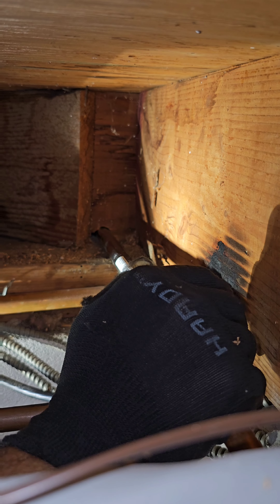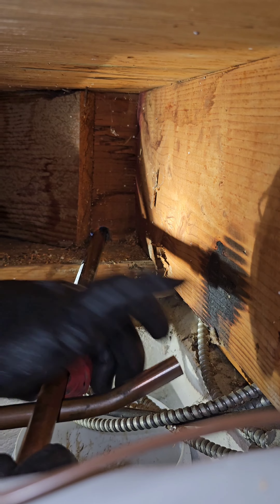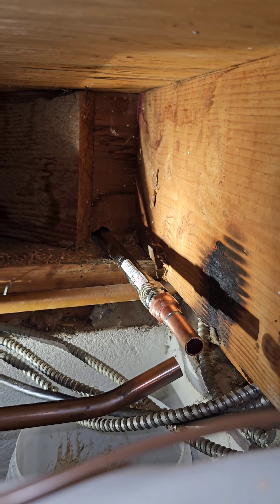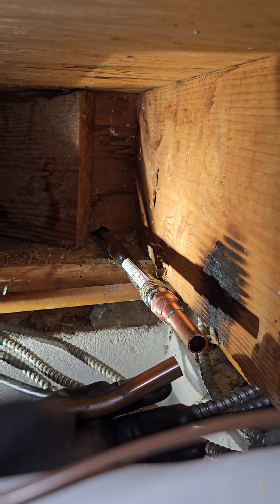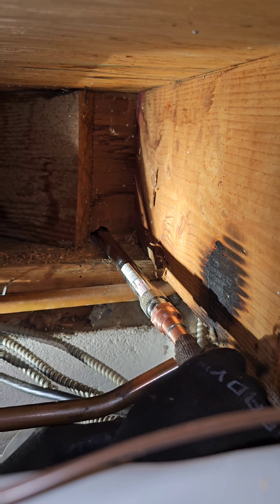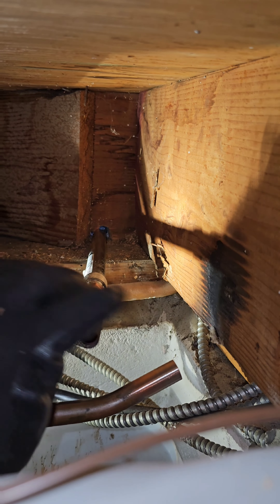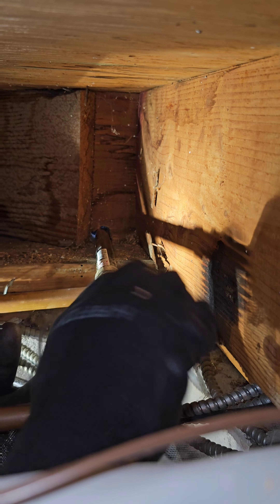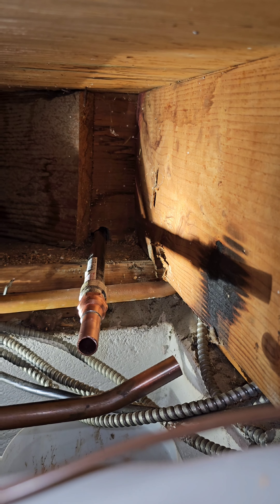Once he pushes it through, I'm inside and I mark it out exactly where it needs to be cut. I pull out the Milwaukee auto cutter. I used to use the orange General cutter - a lot of guys still use that - but I like the Milwaukee one. I'm a Milwaukee guy; every tool I own is Milwaukee, from power tools to hand tools. Once it's cut, remember: clean your fittings, clean your pipe. I clean everything again, making sure it's spotless with no grease left, since anything will interrupt the soldering job.